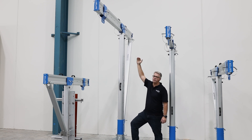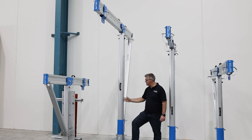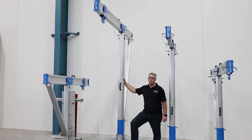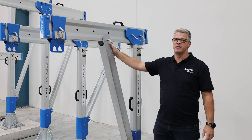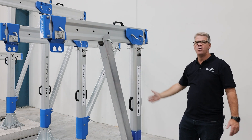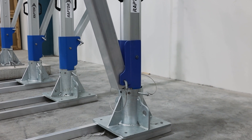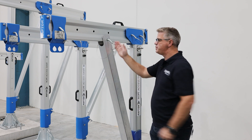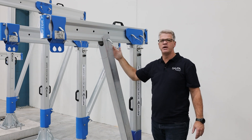Finally, we have our big beast — this is the one that goes up to 2.6m high. We have a 2.5m standard model and then a 2.6m model if requested. It still has the three components as per the other models. This particular model has an additional internal sleeve giving additional strength. It is also rated at a full 15kN even with the 1400 extension arm. This particular one has the brace in the front, which allows for use where a wall or other obstruction would prevent rear brace clearance, but it does require clear space at the front — no parapet or structure can be present in that area.